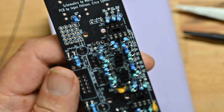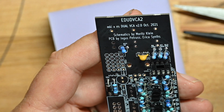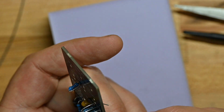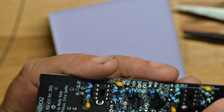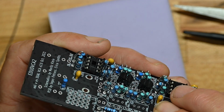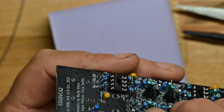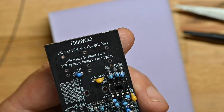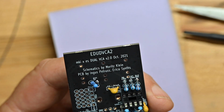a good place to look is right around your integrated circuits, because these capacitors are used as what I'll call buffers for the power going into the IC, to create a little bank of power to smooth out any dips or peaks in voltage. That often happens very close to the integrated circuit to reduce other wire noise, inductance, and other side effects of having too long a wire run.